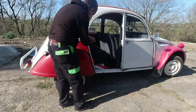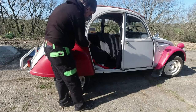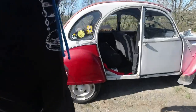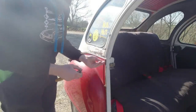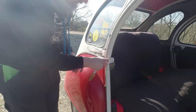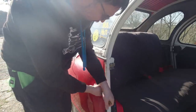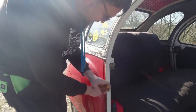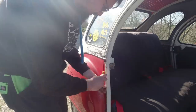I might need to replace these - these are not feeling good. These have been in place for about five years and yeah, they're all going crusty. What's more worrying is the paint has cracked here as well - just what happens with paint, it just seems to crack eventually and let the moisture in. There's severe danger this might be turning into one of those jobs that just escalates. I did use stainless steel at one stage but stainless steel reacts with normal steel and that can just make things worse, so yeah, it's hard to know what the best thing is to do sometimes.